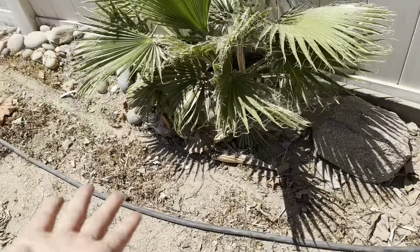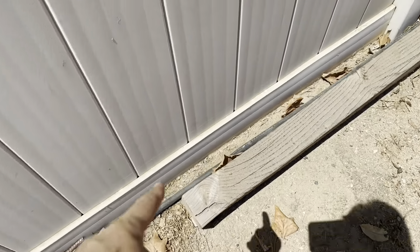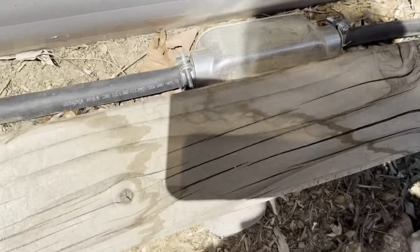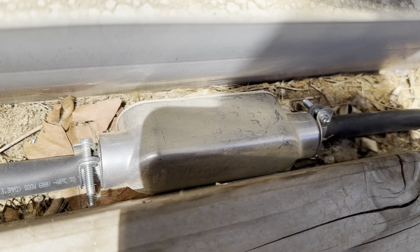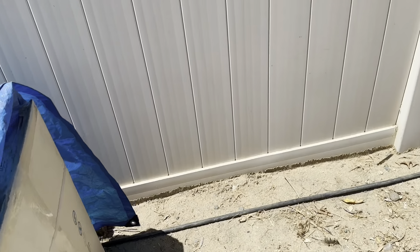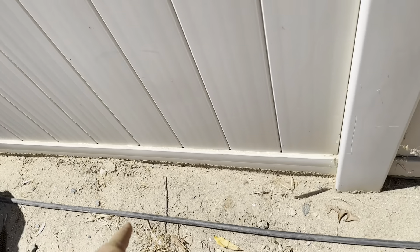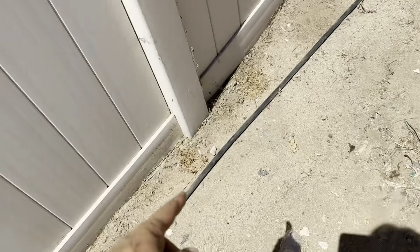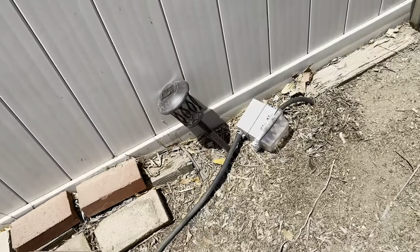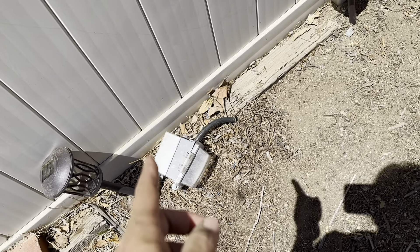The unprotected section is going to be up against the wall — I'm going to tuck it closer against the wall. Now this is tucked and hidden away. So if I decide later on I want to add more PVC, I can just route it through there — that'll be so much easier. That's a junction where the 6-gauge goes into a 10-gauge. This continues on for the last remaining 25 feet as a 10-gauge. It's 100 feet of 6-gauge, and the last 25 feet is 10-gauge.